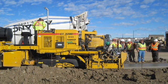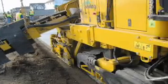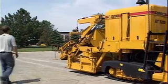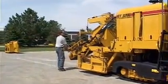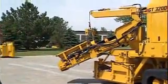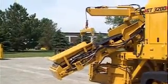The second or slip forming pass is accomplished with a unique trailing mold with minimum side clearance for paving your sidewalk project. The mold is charged with a 14-foot, 4.3-meter conveyor. The conveyor allows ready-mix trucks to discharge from the street instead of driving over existing curb to reach the paver. The hydraulic pivoting conveyor has been designed to rotate 180 degrees to allow for easy loading of concrete from either side of the machine and to avoid obstacles associated with zero clearance paving.